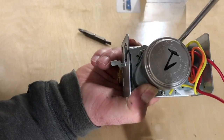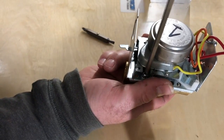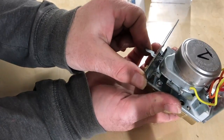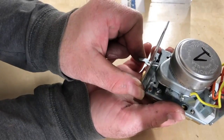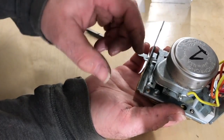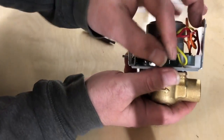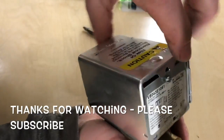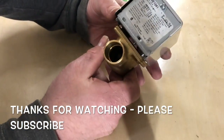Tighten that up and then drive it manually — it should work nice and smooth with no popping noises. If there are popping noises, something in the alignment is off. Then slide the power head cover on — there are two little grooves on both sides, just push it down. I hope you enjoyed the video — don't forget to hit the like button and subscribe.